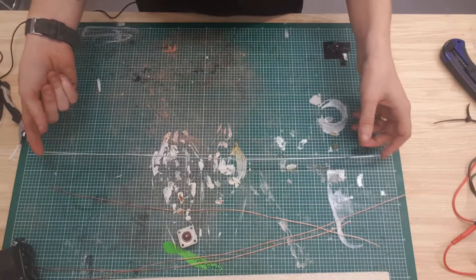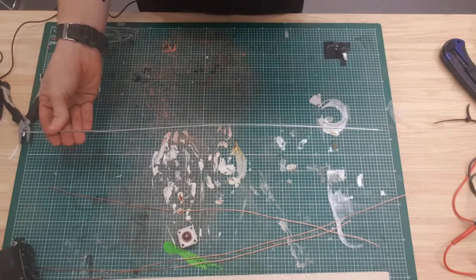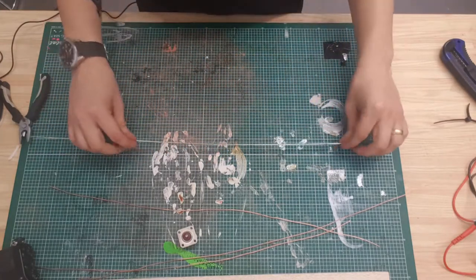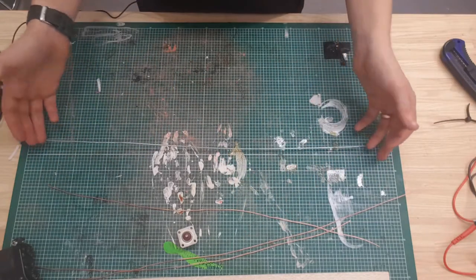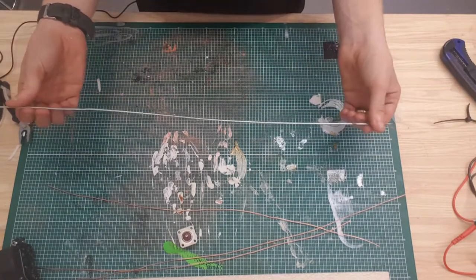So what I'm doing differently is I'm actually using a bit of metal from a coat hanger, so I'm assuming it's aluminium. And that's perfectly fine. You can use aluminium as an antenna. That's not a problem. The problem, or potentially the problem, is I don't have enough of this material to make everything. I just have enough on hand to do the quarter wave.